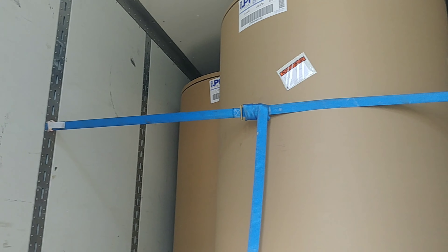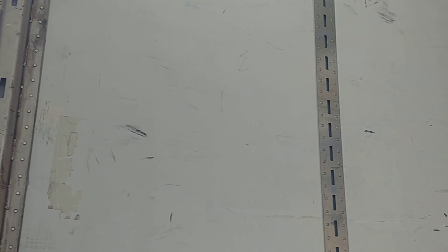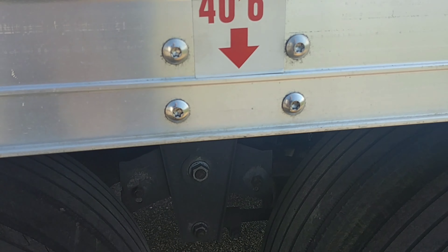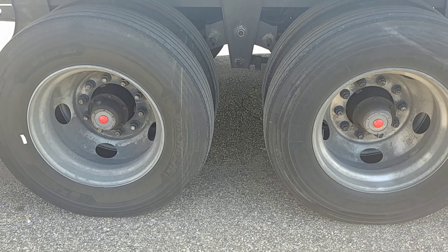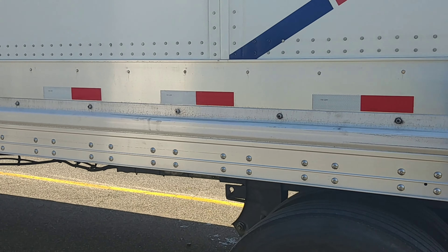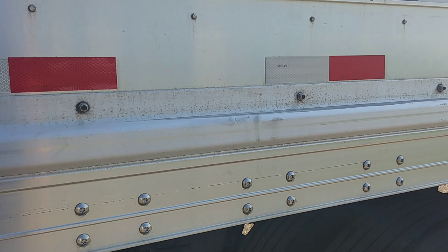You can see the back of the load is there at the strap, and there's two panels. Here's the door, then there's two panels, so I count the panels. Back of the load would be at this rib right here, which would be about eight feet from the back. With this between the wheels — that mark goes right between the wheels — and that's as far back as I can legally put the tandems.